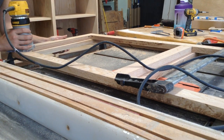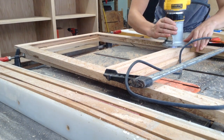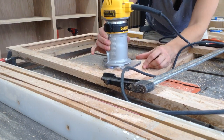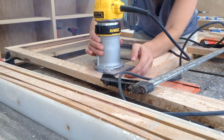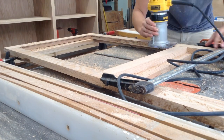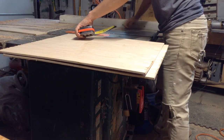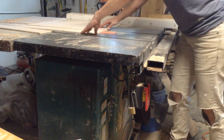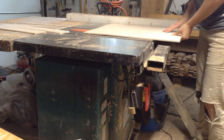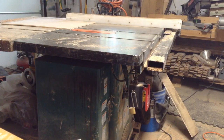In the original photo, the panel's kind of cheated to the front — it's not recessed by very much — so that's what I did. That's the nice thing about the router: you can adjust the height of that bit. This is an older bit so that's why it's smoking, and this is oak so it's quite dense. The groove is going to be cheated toward the top, and then the cutoffs from the backer — which was quarter inch — I'm just going to rip down to size to fit in the three bottoms.